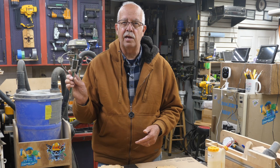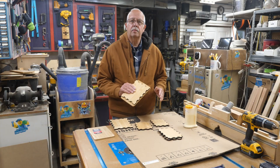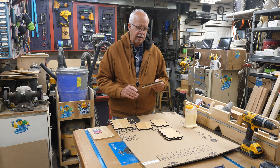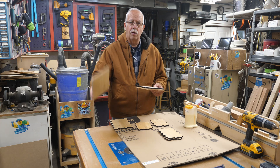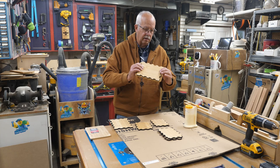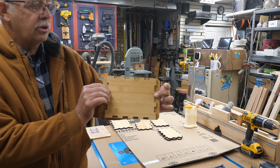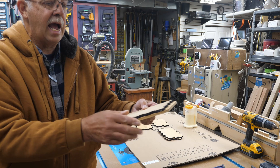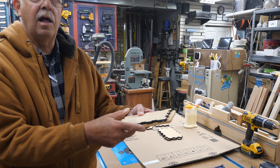The design is based off 7.5 millimeter thickness. So a caliper is a handy tool to have. If you have one that's really different, don't use that one. For the front and back, you need to be very precise on your placement of the cutting board on the laser bed and frame it. I'll show you why because I'm going to hold a cut front panel up against the board — as you can see, there's very, very little play there. You need to be exact because this is almost right on the edges.